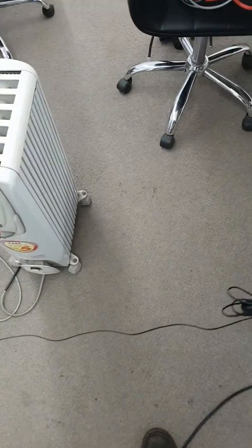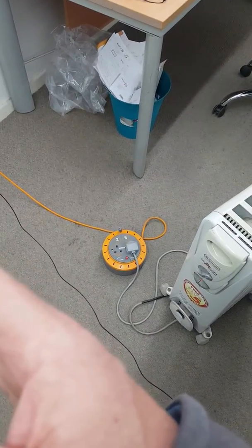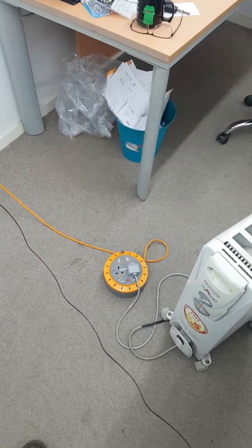If you're ever extending a CT clamp, it's quite an easy way to do it. Just coil all your extra cable on the ground, make up the CT clamp, and test it. We know it's working before you go and lay it whatever distance you're going to run.